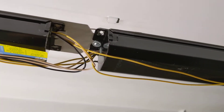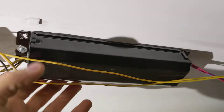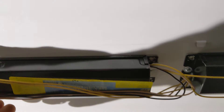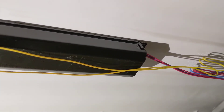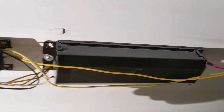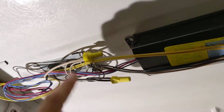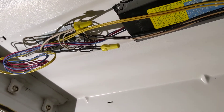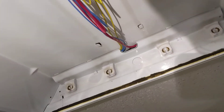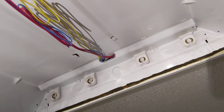And we're back. So yeah, you can replace these old magnetic ballasts with new electronic ballasts, or you can go the easy way, which is to completely cut them out and wire them directly into hot with the new Type B LED bulbs.